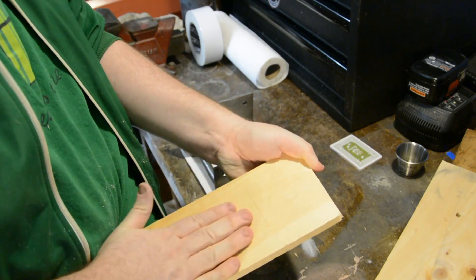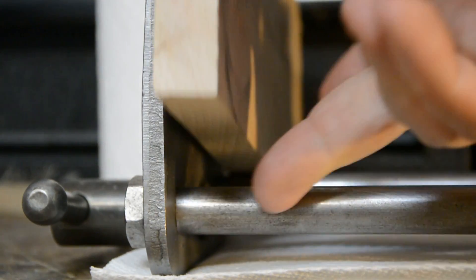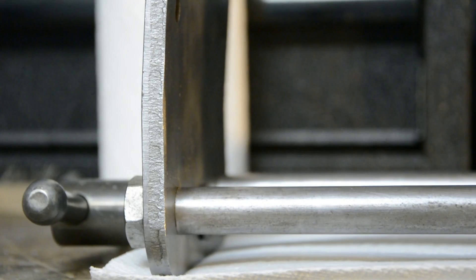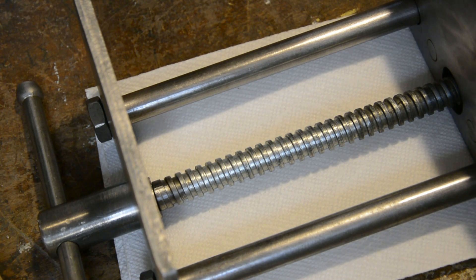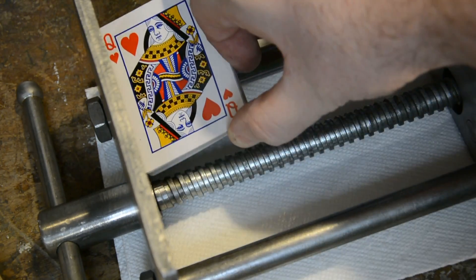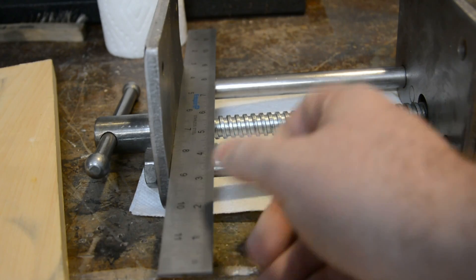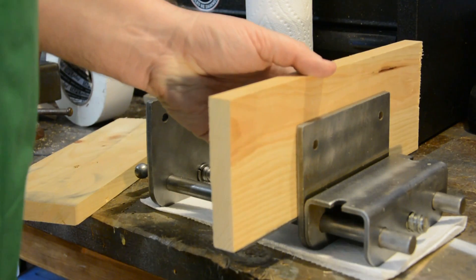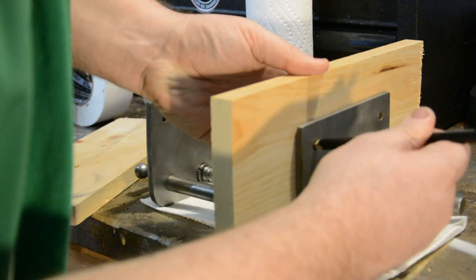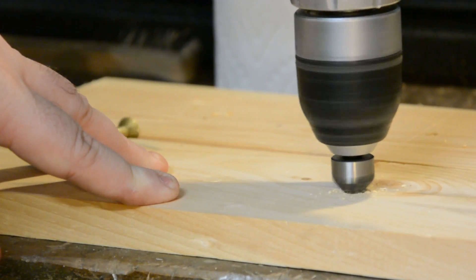There is something to think about when you put the wooden jaw liners in — you don't want to have them down on the bars on the bottom, so you want to use a spacer. Normally I use playing cards: five playing cards is a sixteenth of an inch. But as you can see here, my cards don't reach all the way across both bars, so I'm going to use a ruler, which also happens to be one sixteenth of an inch. You can then use that spacer, putting the wood on top of it and making sure it's centered, to figure out where you need to drill your holes. You drill those out, make sure they're countersunk, and then you put the whole thing back together.